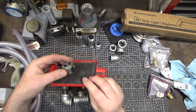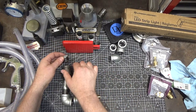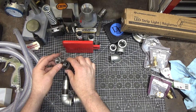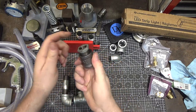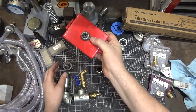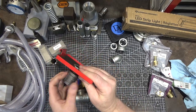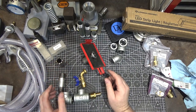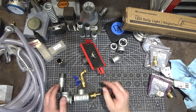I'm going to drill a hole in the center — this guy goes through. However, because standard pipe threads are tapered, I need to make a spacer so this will actually hold in place on the bottom. I used an annular cutter and made a 1.125-inch hole. This will pull up tight long before it reaches the plate, so I need a spacer at least that thick. The sheet metal annular cutter set I had only goes up to three-quarters of an inch and I need one and an eighth — whatever you buy, you won't have the right size. That's just the nature of the beast.